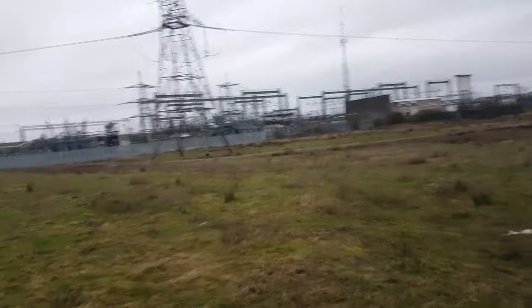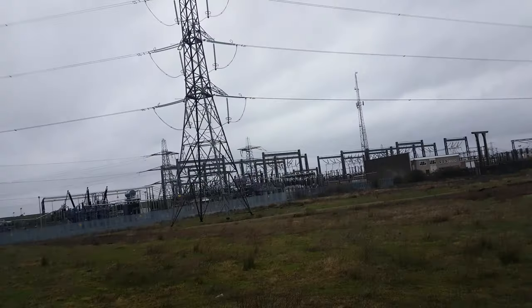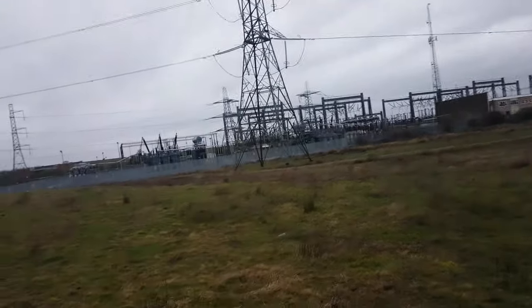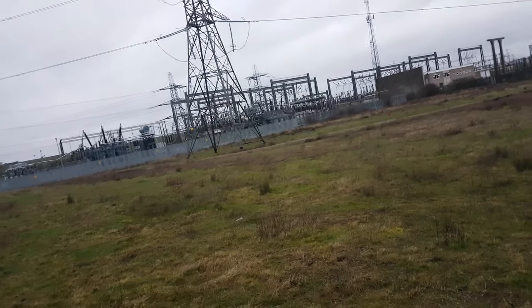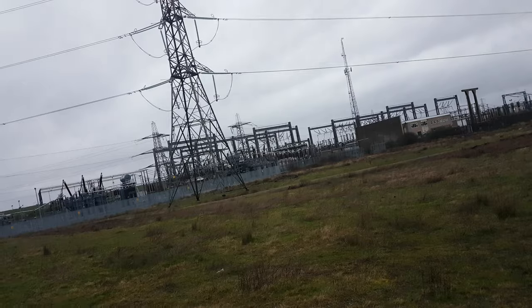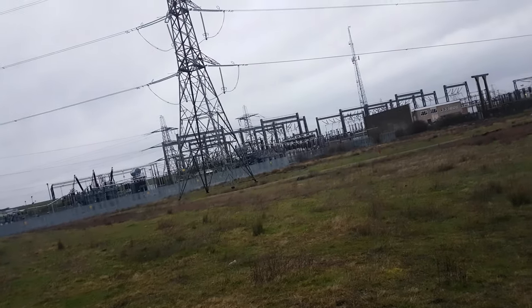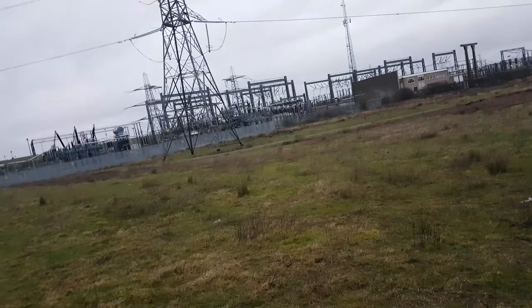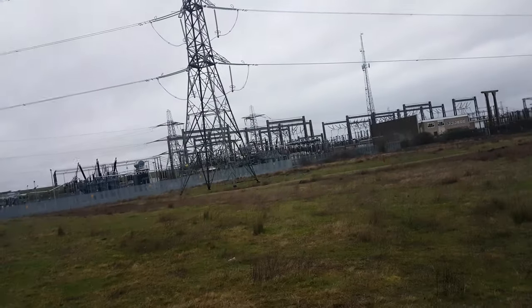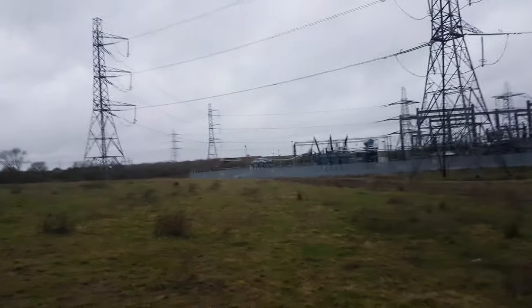There's an obvious substation, so it steps down. There's a power station where it steps it up from 25kV to 400kV, and gradually it steps it down from 400kV to 275kV, 132kV, and then down to the distribution — which is 66kV in this country — then 33kV and 11kV, then down to three-phase 415V, and single-phase 240V.